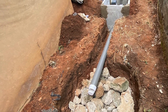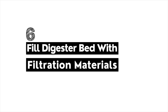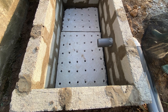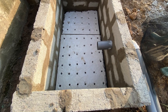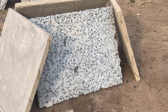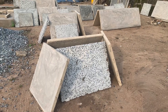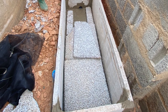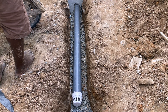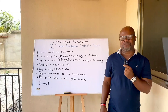The sixth simple step is to prepare the biodigester bed, including the bedding materials. When casting the top slabs, you cast a perforated slab with holes left in it. If using prefabricated slabs, we use chippings made porous for filtration of the bedding material. You lay them on the biodigester; having done your screening and a gradient leading straight into the soak away pit, any water that comes into the biodigester is drained out immediately — that is what we call rapid separation.